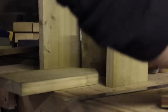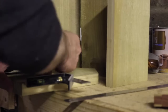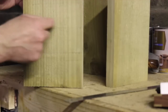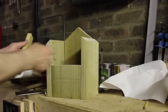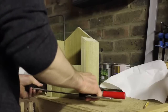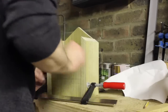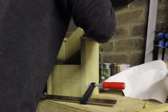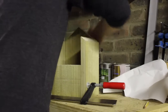In this case I'm going to come down 100mm from the bottom of the pitch. That should give me a nice amount of room for the hole and maybe for a little platform. The next thing I want to do is put a couple of blocks in to screw the front on. I'm just going to clamp it in place to keep it all exact.